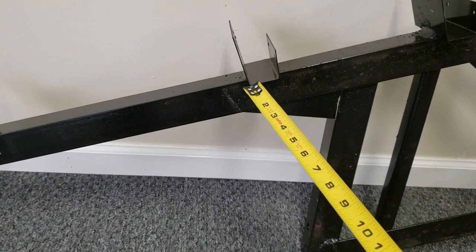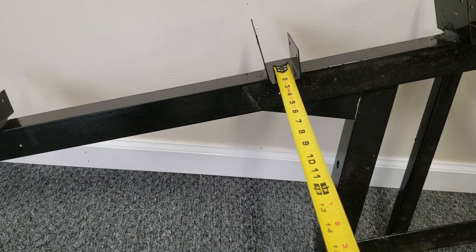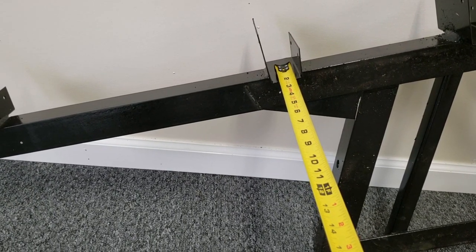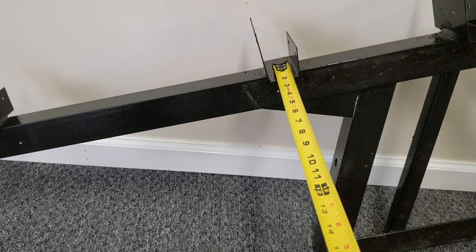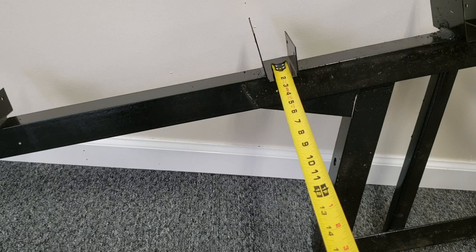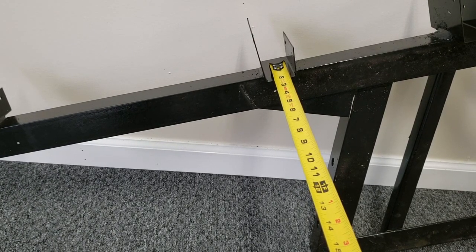The 2x6 purlins that you put in the cups just butt joint halfway, and that way you can go in 10 foot or 12 foot increments. Most of the prints are going to call for 10 foot increments — a lot of our agricultural people still put them at 12 foot, but the print actually calls for 10 foot centers.